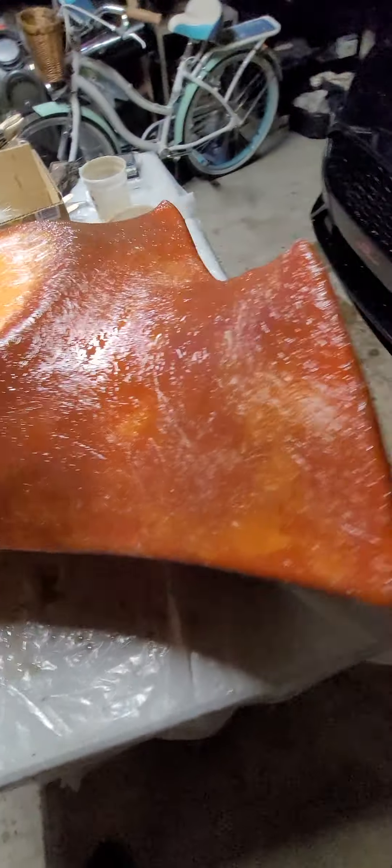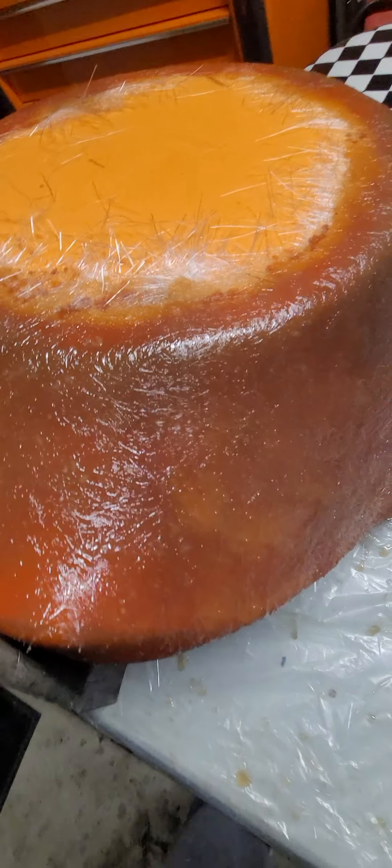I want to build up the strength on this edge and all the way over to the face — that's where all my matting is going to be, that's where the thickest part is. The back shell underneath here is already strong — it's already got four layers of fiberglass, plus the fleece that's folded over it is soaked in resin as well. Everything is structurally sound here already, and your corner is going to be very, very strong. You want your matting to mainly be on the face of this. Like I said before in a previous video, you don't want cut edges of mat. I want to lay some of the fibers that are hanging over across here just to add that little bit of extra strength.